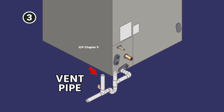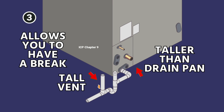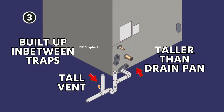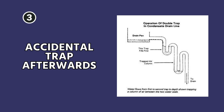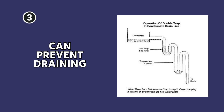In most of these applications, you're going to want to have a vent pipe after the trap as well, and that vent pipe generally needs to be taller than the drain pan. What that does is allow you to have basically a break so that you don't get an air bubble built up in between traps if there is more than one trap. This is especially important in the case of common or communal drains where you have more than one drain connecting in, or if you have an accidental trap after this point — you don't want air trapped between the two traps, which can prevent draining. That's what we call a double trap.